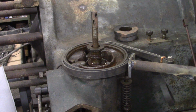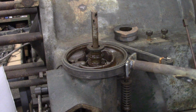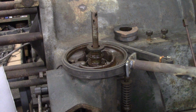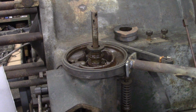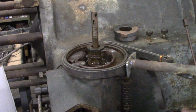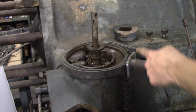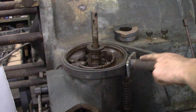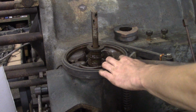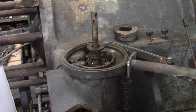And that's it. Now I can pull on it, and it seems pretty good. I'm kind of leaning into the bar, putting, you know, half of my body weight into it, and it grabs very well. I mean, the nature of this tool is that it is self-tightening, whether it's a chain wrench with the teeth or a strap wrench where the pulling action itself forces the foot against the strap, against the object, and tightens everything. So it works very well.